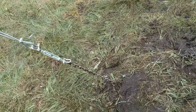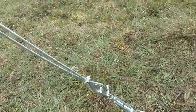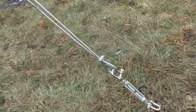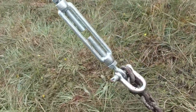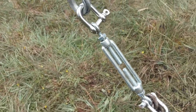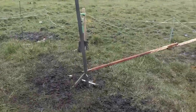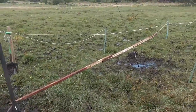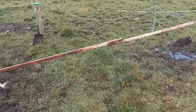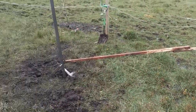The ground anchor situation is just a bit of tanalised fence post buried half a meter sideways — very standard, with turnbuckles and D shackles. We're going to replace those M8 turnbuckles with M10s, which should solve that problem. The boom to pull it up and down is quite helpful, especially with the weight on top. We're going to put a bit of rope on the top of that to make it even more ergonomic.